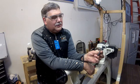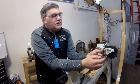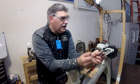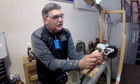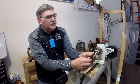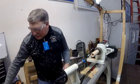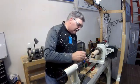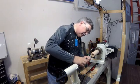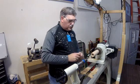The number one, or A, I don't remember which it is, has a round shank, and I didn't want that because I know that frequently things twist. This has the octagon shank, and then the number three, or the C, is all carbide, so it's very expensive, so I didn't think I needed that one either. So even though I want a hole of an inch and a half, I went ahead and removed that material with the 1 3/8 just so it's faster. And now this bit doesn't have to do nearly as much work.